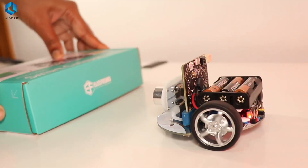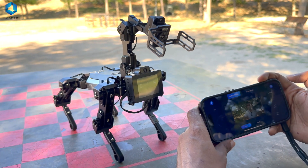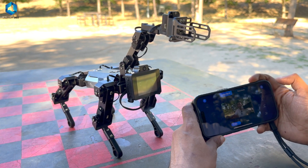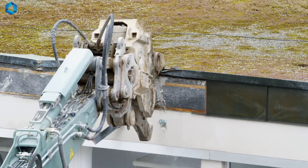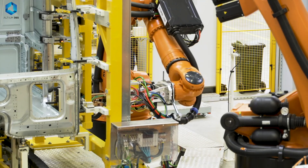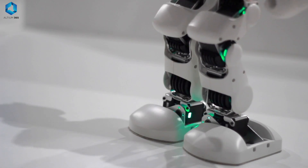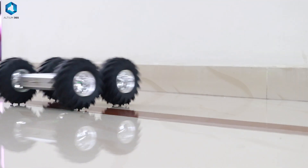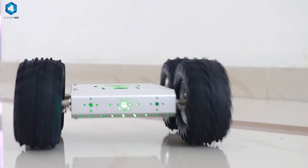So how do you choose the right actuator? It depends on the purpose. For fast-spinning wheels or fans, go with a DC motor. For robot arms that need to move to a certain position, use a servo motor. For high-precision control where each tiny movement matters, a stepper motor is your best friend. For big industrial projects requiring a lot of force, pneumatic or hydraulic actuators are the way to go. The key is understanding your robot's job and picking the actuator that fits best. In the next video, we'll be creating a simple robot using a DC motor and an Arduino microcontroller.